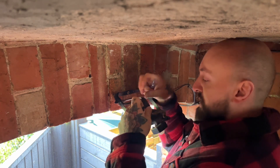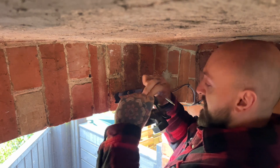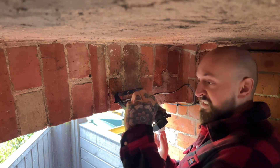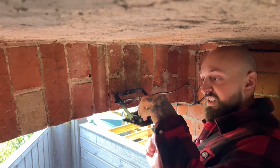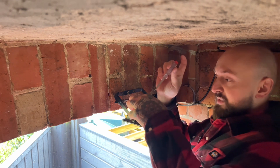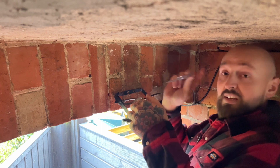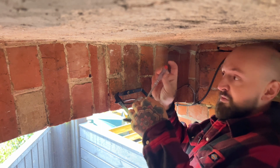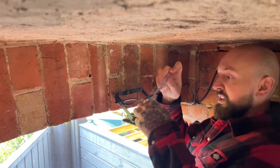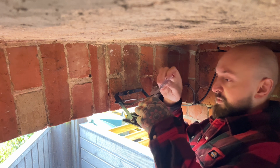I don't know if that's what's broken this light - I would guess probably it is. So there's that tape off and you can see underneath it's just a standard connector. We've already isolated the power to here, but I'm just going to test it. Yeah, there's no power coming in here now so we can work on this without having to avoid live cables.